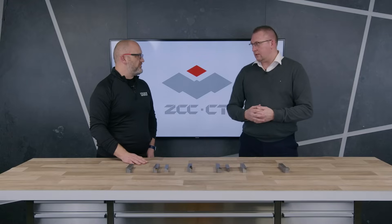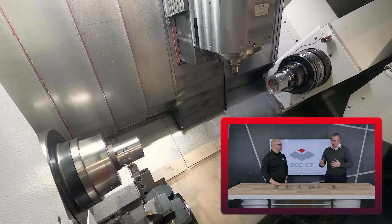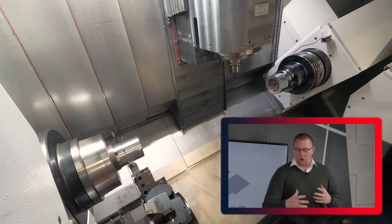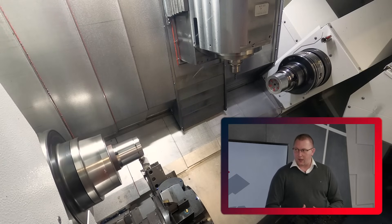I'm eager to learn a bit more about some of these grades — you've got some quite clever grades going on here. When we talk about the ISO grading system, these are P materials. We've got P05 up to P50. Historically, on the hardness to toughness chart, if you were P10 or P15, you'd be in finishing territory, and P35 upwards at the rough end.